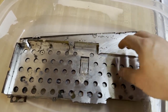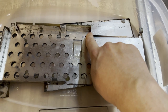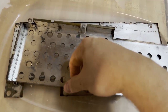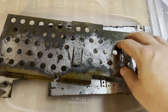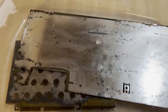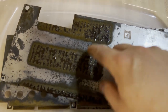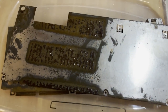The top half of the RF shield looks pretty good where it's mostly clean, whereas where I couldn't get at it with the brush in the corners, there's some corrosion. But where there used to be corrosion, there's now these dark spots. It looks awful, but I can feel that there's no bumps, so that tells me that the rust is gone. I haven't soaked this in baking soda yet because I'm going to put this back in the acid bath — the other half of the RF shield is still in terrible shape. The underside is awful yet, and this is after some significant scrubbing, so I'm going to attempt some mechanical removal with a scraper, then put this back into the acid bath.